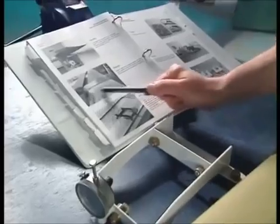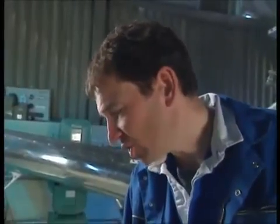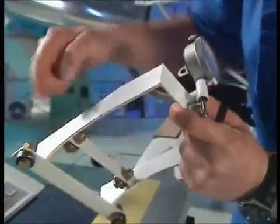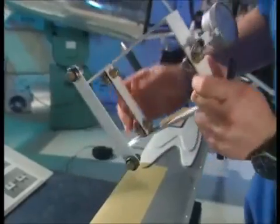Slight error where I've sawn it, but no worries because a bit of filing will soon sort it out. Perfect. Next job is to establish a consistent chord line all the way along the blade, so you can make a reflex trailing edge template and check each blade from end to end. A more precise method is to use a dial indicator mounted on the reflex edge fixture, available from the parts department — and yes, I've bought one of course. You've got to have the gadgets.